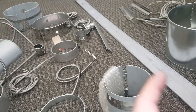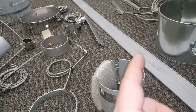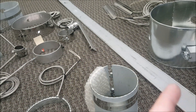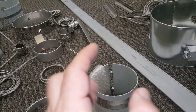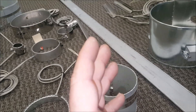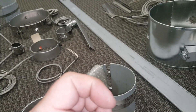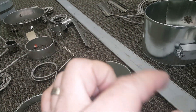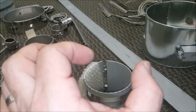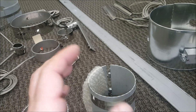A mica strip heater is just that — a strip of material. It has mica insulation inside with a nichrome element, and it's made to a certain watt density for your process. A strip heater can be bolted onto the process, strapped onto the process, or could have a pressure plate put on top of it, evenly spaced. A band heater is basically a strip heater that was curved to the cylinder — the outside diameter of a pipe, nozzle, or transfer line.